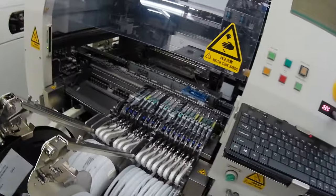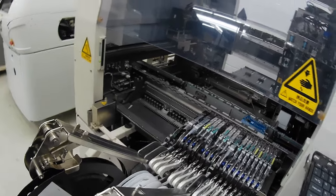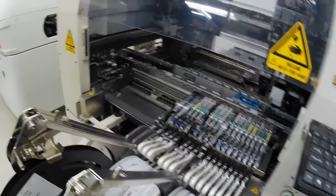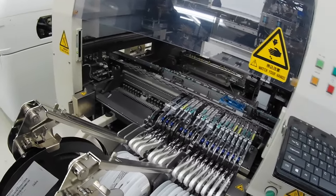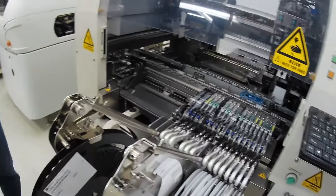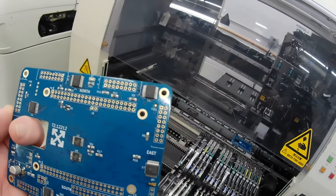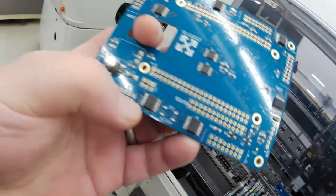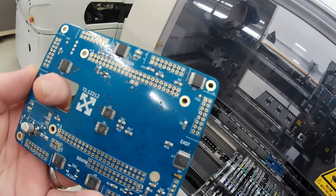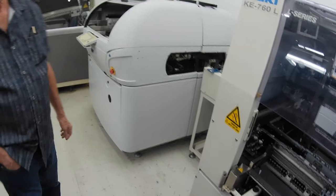And so, like the switches, for example, there's really no good way to grab them. We could place them, but we wash the boards. We don't want water getting inside. I get it. Like that. And the big electrolytic cap that he was placing, our feeder wouldn't take it for some reason. It just wouldn't fit good. So there's one little extra step. Well, that's very cool. They need a little touch up after there. So then you take a look at each one with the magnifier and just look for bridges or whatever, exactly. That kind of thing. Well, this is super. So it's not worth the while to try to actually mechanically connect these things up so they can zip through. But I want to take a look at them. That makes sense.